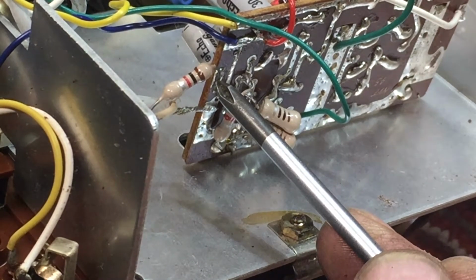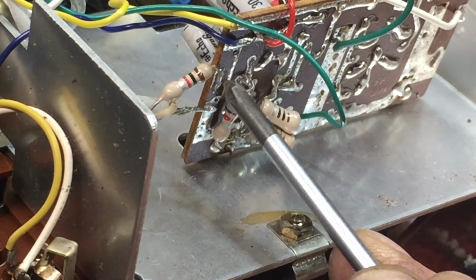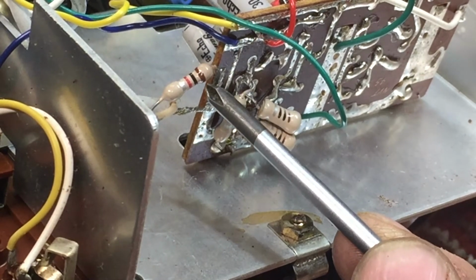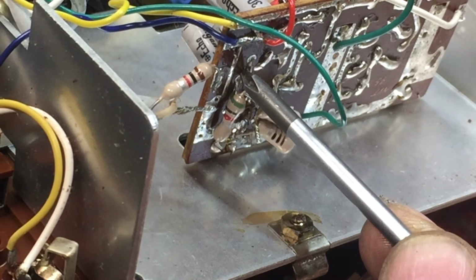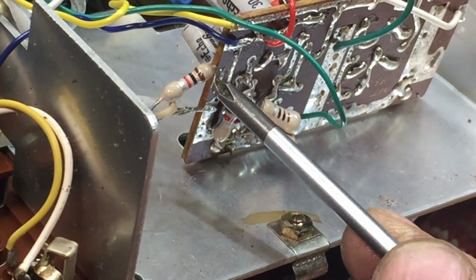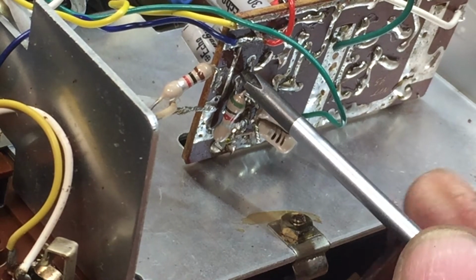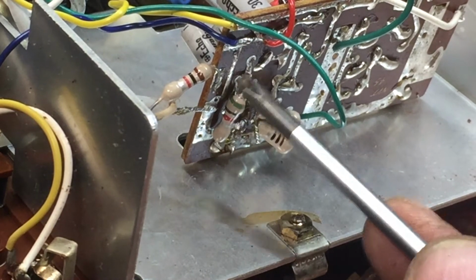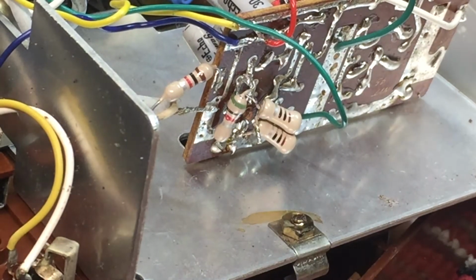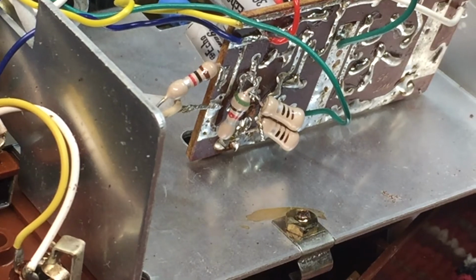And then there's a cap, a 5 microfarad cap, that should bridge the audio into the amp. And so you can hear we don't have any audio hum here, but we have audio there. So got ever so faint, but plenty of audio there. And so that's telling me that that cap is probably open or nearly open. So let's stop the tape. Let's grab a 4.7 microfarad cap.